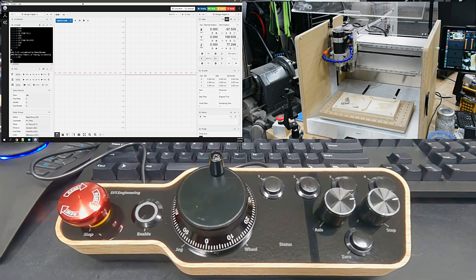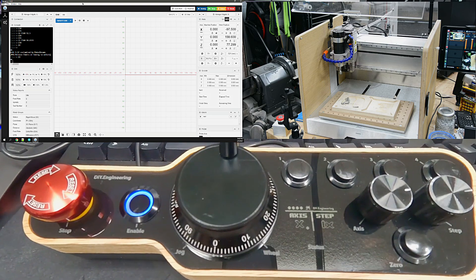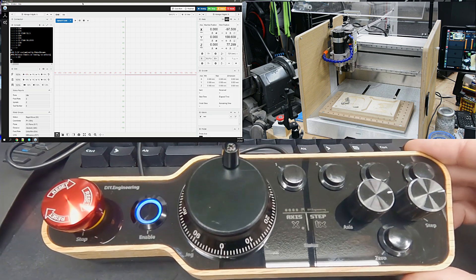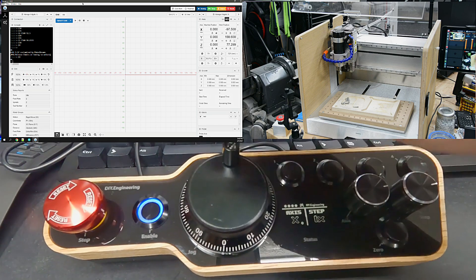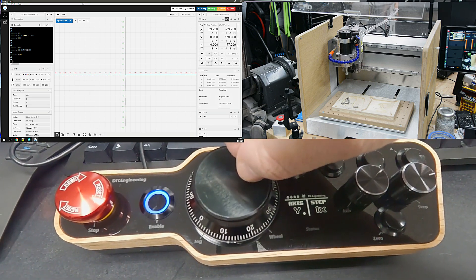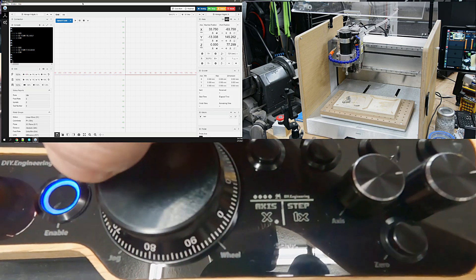With CNCJS running, let's look at the general behavior. Initially the pendant screen is dark when disabled — no buttons work except the e-stop, which should always be available to halt the machine. When the enable button is pressed, it lights up to indicate it's live, and the display comes to life actively showing all button and switch states. We can press buttons to perform basic operations like unlock, home, and reset. We can adjust the axis and step multiplier for the jog wheel, then use the jog wheel to move the gantry in either direction with speed relative to rotation. The controlled axis changes with the selector, giving jog control of X, Y, Z, A, B, and C axes. When jogging the wheel, a Space Invader icon animates as a visual reference that the input is being processed by the controller.